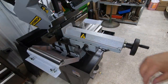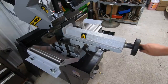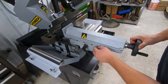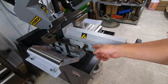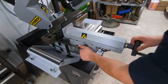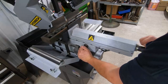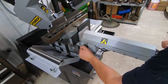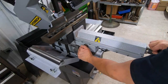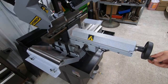Let's show you a couple of the features of the vise. You've got the conventional screw vise with the handle right there. It looks like I might need to do a little adjusting on a gib in there, but this thing has a quick-action feature where it releases the half nut with this lever right here, so you can push this down. It's spring-loaded — just push it down in the vise so you can pull it all the way back or push it all the way in, position it where you need, lock it in, and then go ahead and screw it tight.